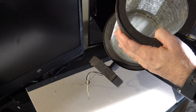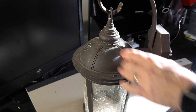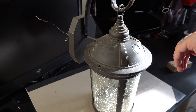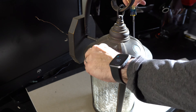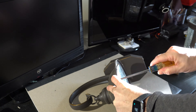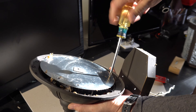There are the LEDs at the bottom — just tiny little things that light up in there. There's probably no need to go through a step-by-step disassembly: you remove two screws and get the frosted part off, and then all the guts of the device are in the top. There's a silver plate held in place with three screws, and at that point you can access the wires. If you're reasonably good at taking things apart, you should have no problem.